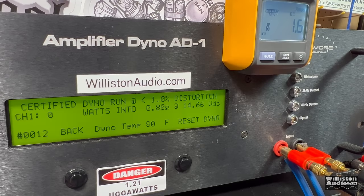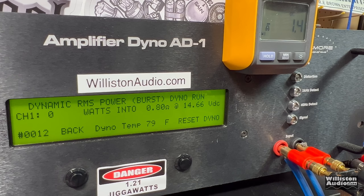If you know, then you know to stick around to the end. Let's try certified at 0.8 ohms: 1,276 watts at 14.18 — handled 0.8 ohms no problem. Dynamic at 0.8 ohms with a 40 Hz burst: 1,930 watts at 14.2. The amp is not recommended for under 1 ohm loads, just so you know — we did try 0.67 ohms dynamic and it went into protect, but came right back out. Nice protection circuit, nice power. Check the link in the video description and go buy one.